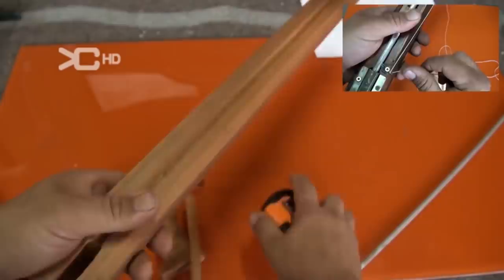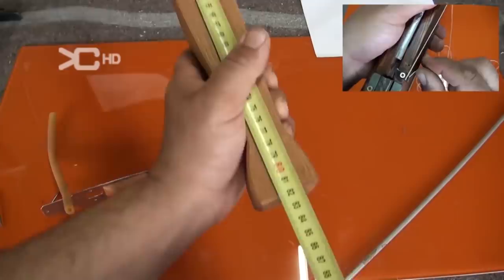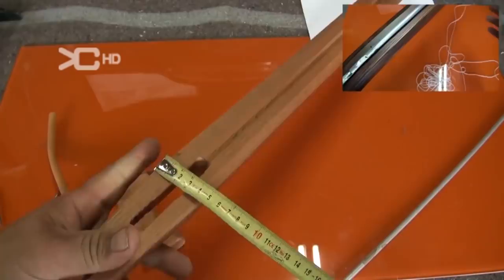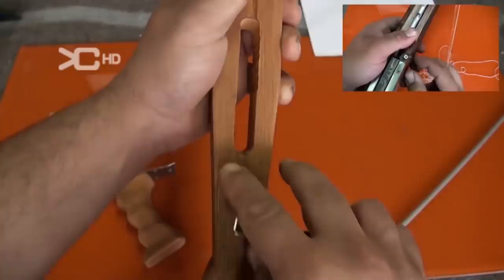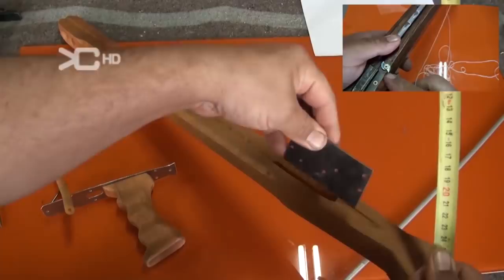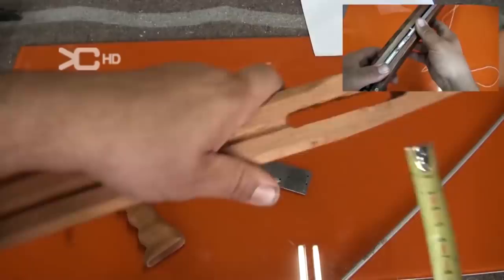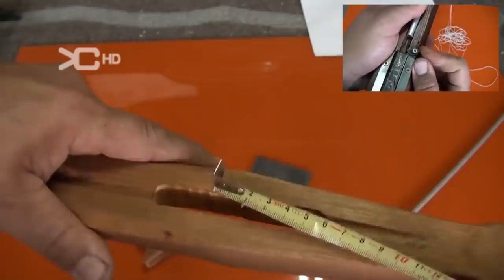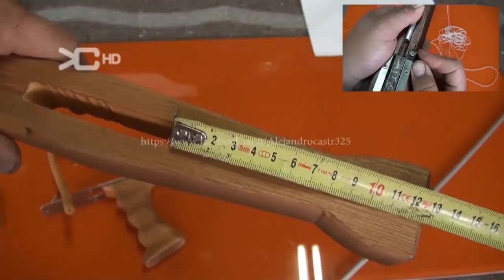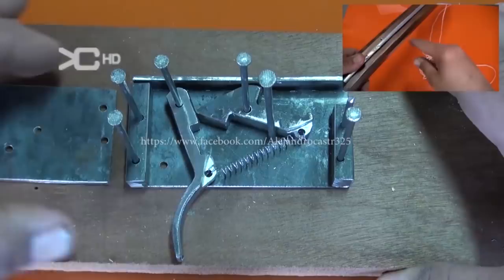The ball I have used mainly as a body — not the most adequate material, but to show you the work. The total here is 5 centimeters. What happens is that here I have made this small shape where the rubber bands — the trigger part — will enter: just 9x4 centimeters. I will leave the rubber band thickness at approximately 1 centimeter with 3 millimeters. I have placed this at a distance of 21 centimeters, and here 12 and a half centimeters, as you can see. I have placed this on a small wooden board before mounting it, as I was doing some tests.